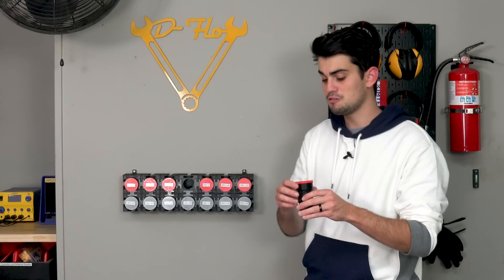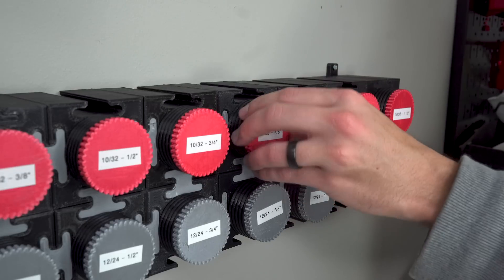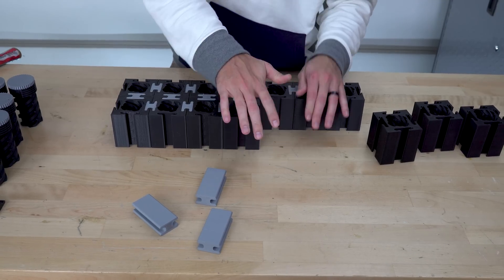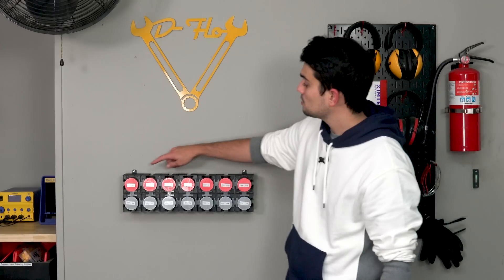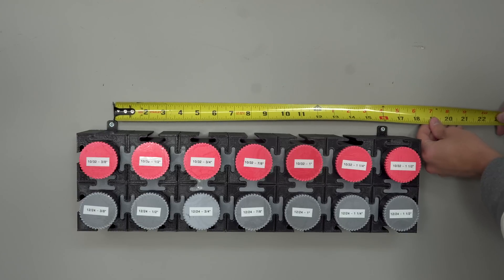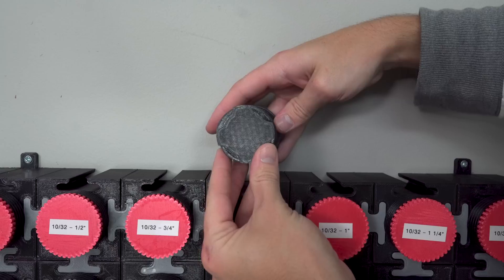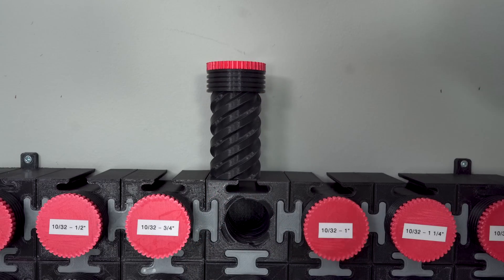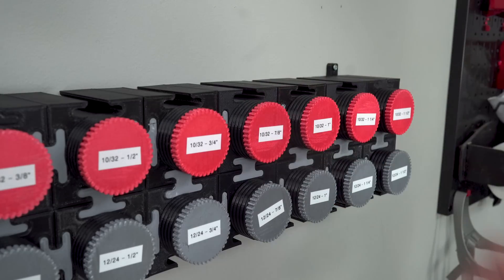When I return, I can screw this guy back into its housing, which I'm calling the nut. The nuts can be chained together with this joiner, and from here this assembly can be placed on a bench, in a drawer, or even mounted to the wall. I made sure that the distance between the first and seventh bolt, the center distance, is 16 inches — so it's really easy to mount this to the wall and hit those studs. I could have just designed the organizers to be straight cylinders, which would have been more economical, but this four-start lead screw design was just too fun and satisfying to pass up. It only takes one rotation for the bolt to move 75 millimeters.